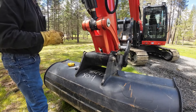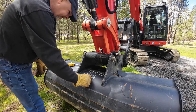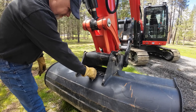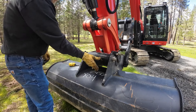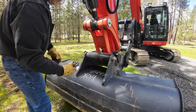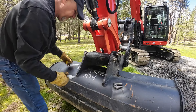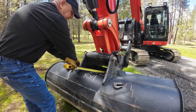I've got to judge my positioning here. On my four-foot bucket on the 40, I put it too far up and it wasn't too bad with the old fabricated quick coupler. But when I bought the new machine with this cast unit, the hook drops down and it's just a real pain to get the hook in and out. So I'm thinking I want it up a little bit more — move it on up in there a little more.